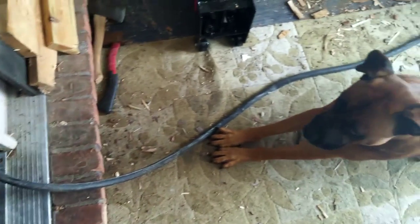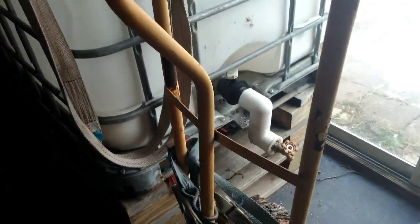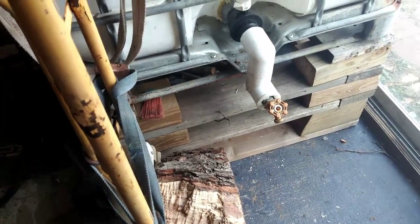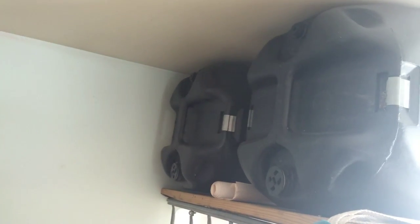Scott is in the basement, or ready to enter the basement. And he's got the generator going out and back, so he's got power for a small submersible pump. What he does is he uses the sump pump to empty out all the basement water, because that's contaminated water, and then he turns on the sump pump to pull groundwater. It's still water that has to be processed, but it can be used. It'll get pumped into this tank, and you can put a 5-gallon bucket under one of these guys. You can use that for flushing, and as Monica said, she can use it for washing dishes after she boils it and processes it to a degree.